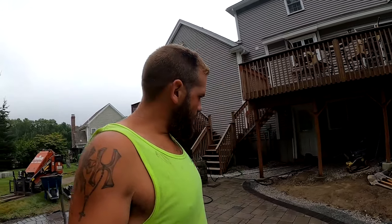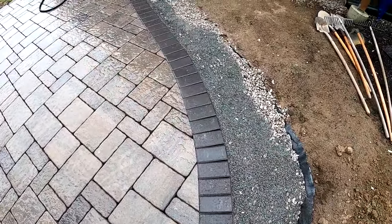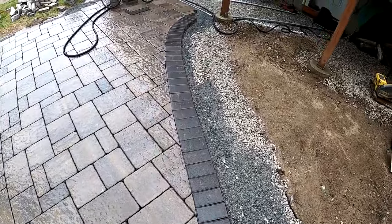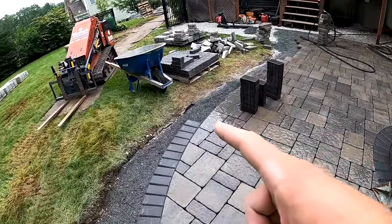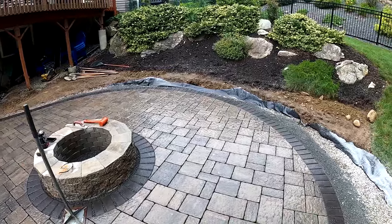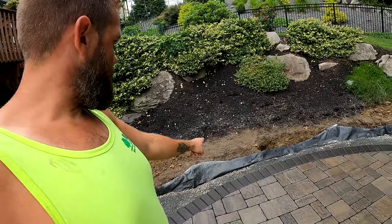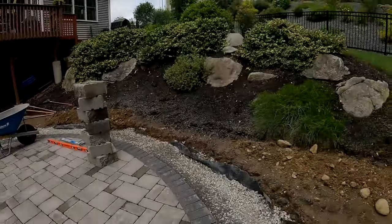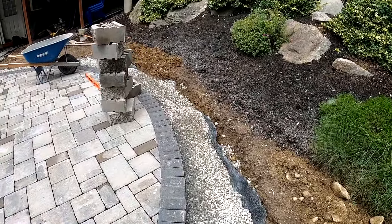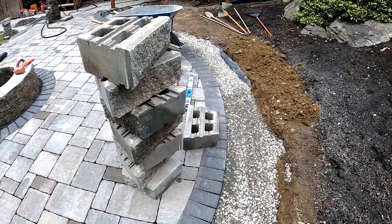The borders are in, in that area we made the cuts — check it out. We're going to take a break from this patio and walkway and start focusing on building this sitting wall. We've got our wall block here, we've got a little bit more excavation to do, then scrape up some of this extra three-quarter inch stone, fill it in, compact it, and start laying our first wall block. The back of this patio where we're doing the sitting wall is excavated, backfilled with the three-quarter inch stone, and compacted.